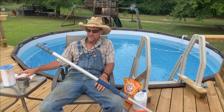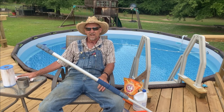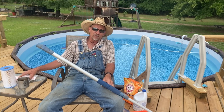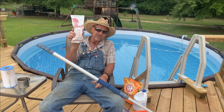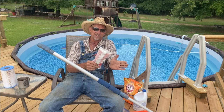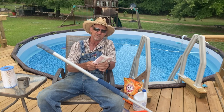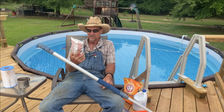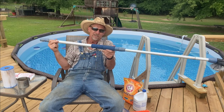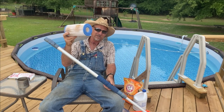On about the fourth day, we were also getting two to five inches of rain a week, so I actually had to drain some water out of that pool the first four days after we filled it. I put another bag of this shock in there around the third or fourth day. The water was so nasty I wasn't worried about testing it at all — my goal was just to get it cleared up. I continued every morning, every dinner, and every evening taking that brush and stirring it up, and kept changing and washing out this filter because it would stop up completely.